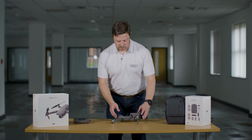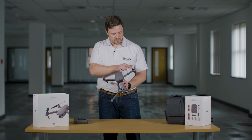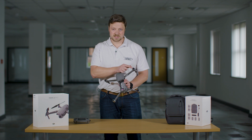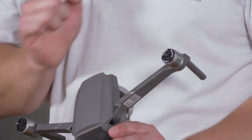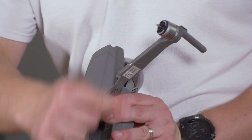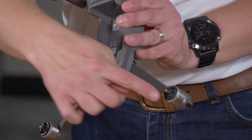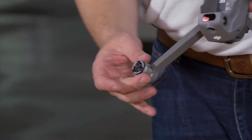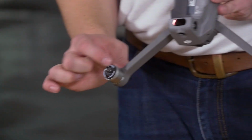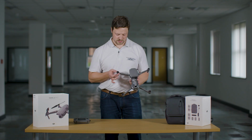The way to note which way round this works is that on the outside of the motors, there are two motors that have got three grey dashes around the outside on the top of the motor there. So this one is a grey motor, or a silver motor as we will call it. That means that the one behind it, solid black on top, is one of the black motors. If we then come across, we expect that to spin, again, the opposite direction to this one. So that has the three silver dashes around the outside. And coming back forwards, the black topped motor there.